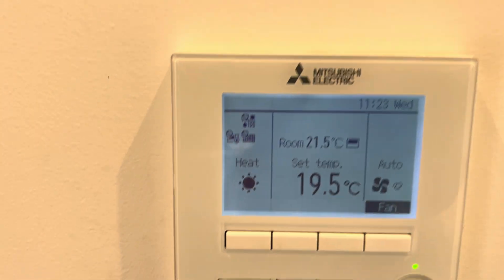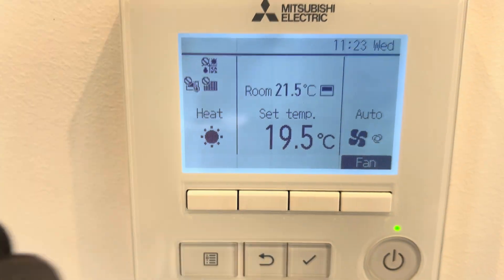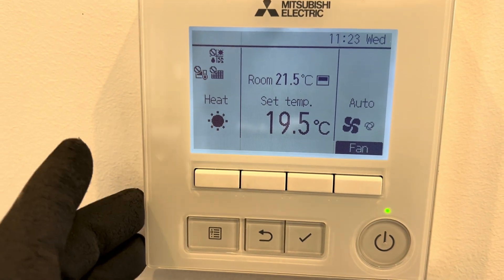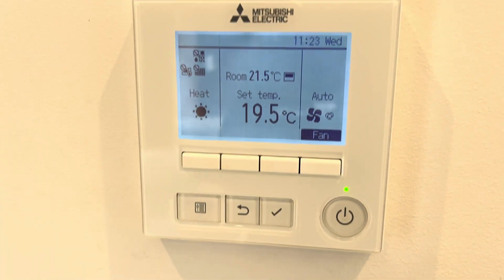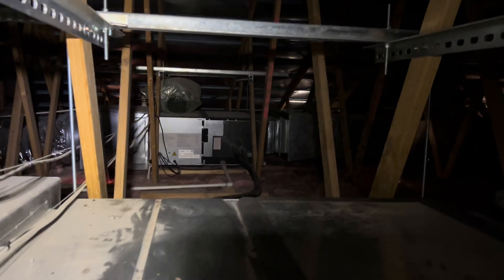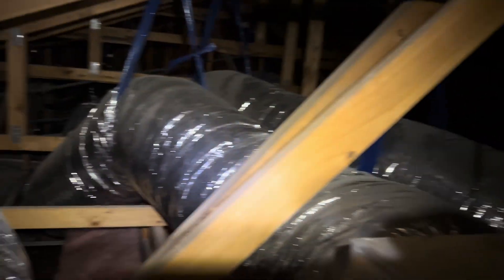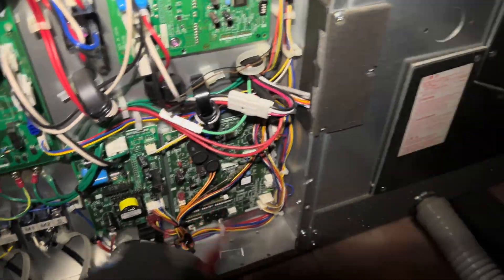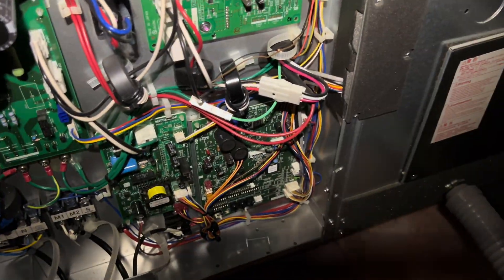This one is reading from the controller, and there's a massive difference between the two. I think in this setting it's best that they both read from the controller. It's on a dip switch setting in the indoor board, so we'll find roof access and go change it. I found the indoor unit — there's the other one over there, and the manhole is all the way over there. Here's our board.